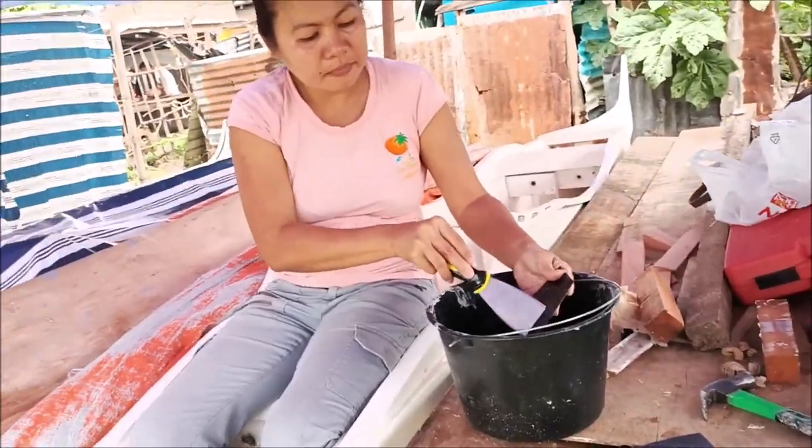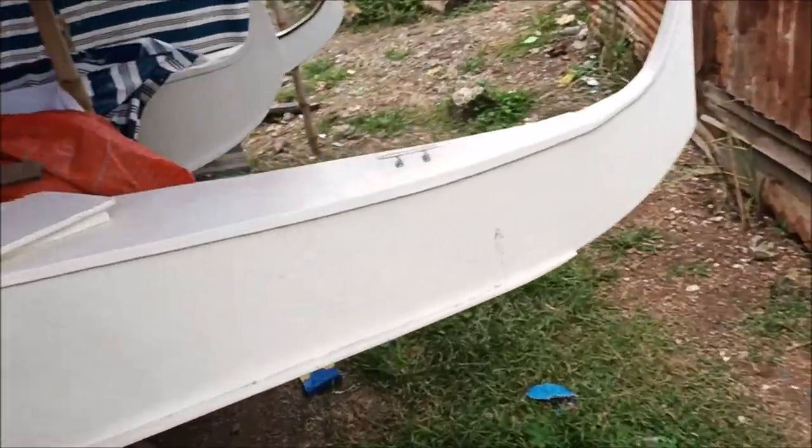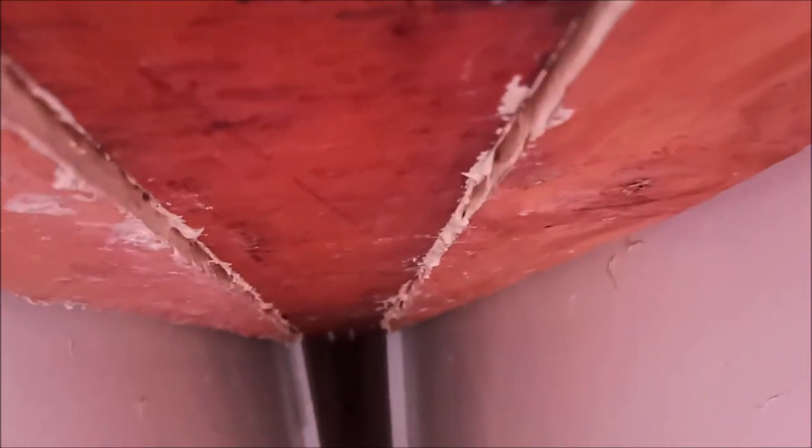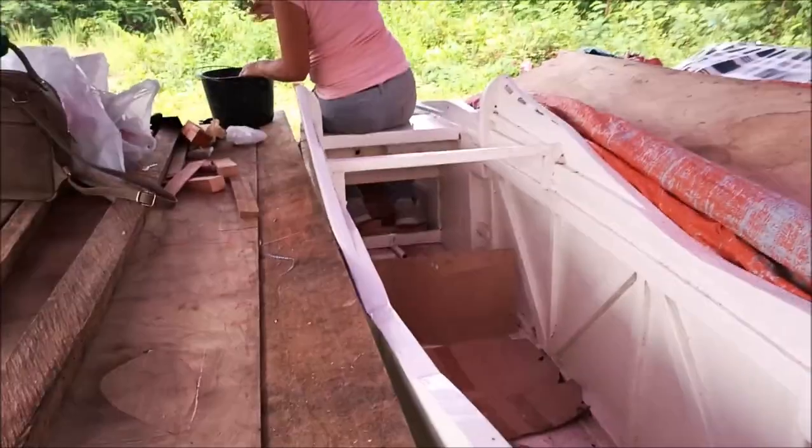The front is all done. We leave covers on the boats when we're not working on them. Here's the end result — pure two-by-fours all the way across. We'll epoxy over these ends and then paint everything with white enamel once it's all dried and the stalactites are knocked off, just to seal moisture out. It's mahogany so it handles moisture well, but paint gives extra protection. She's done.